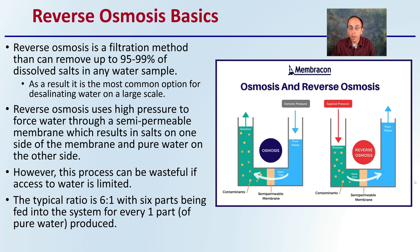As we can see here, normal osmosis would have water working its way through — pure water would try to dissolve the contaminants or salt particles. Reverse osmosis uses the same semipermeable membrane, but applies pressure and forces water going backwards — the reverse process — squeezing the water through this semipermeable membrane, only allowing pure water to come out at the far end.